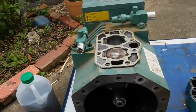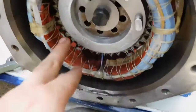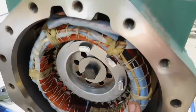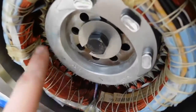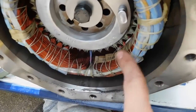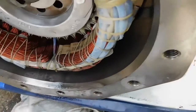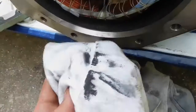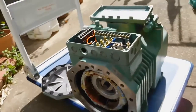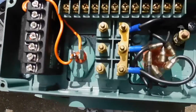Next up we'll get the back end off, and there's the motor. The stator looks just fine - it could be a different story at the other end so I'll have to test it, but it actually looks really good. It still has its varnish on it - they put a very light coating of varnish on these before fitting them. There is a bit of metallic paste somewhere. I have a feeling it may just be a very dirty system that this came out of. This was used on a CO2 chiller so it was running pretty much flat out all the time.